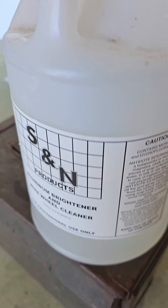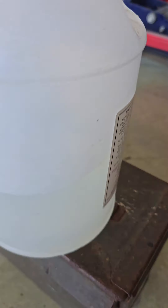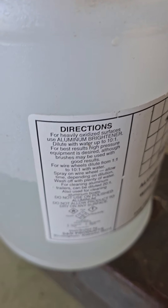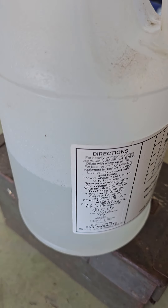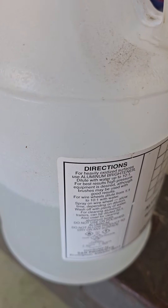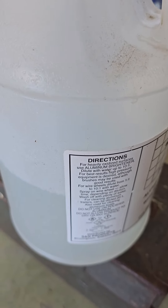This particular brand is local and they are 10 to 1 — follow all the instructions. You can spray this stuff on straight and it will eat the aluminum. It will not damage anything else; it only reacts to aluminum and concrete. So wet the area very well, spray it on, count to 30, then rinse it off.